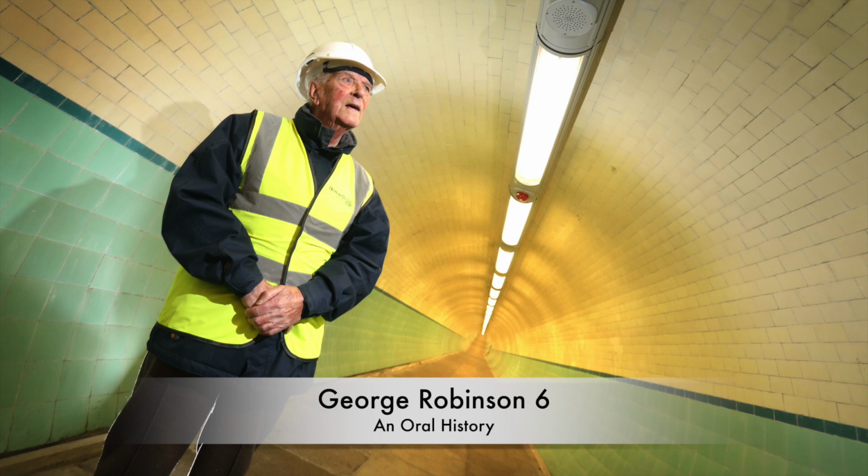Once I was sure that everything was all right, I used to hook the two tails, the wires, to the surface for blasting, connect them up, take me lights, put them under the platform. And the idea was, when you blasted, it just loosened the rock and everything, and it fell on the platform, and it was easily shoveled into the skip by the miners, and it was winched back to the bottom of the shaft and lifted out with the crane.